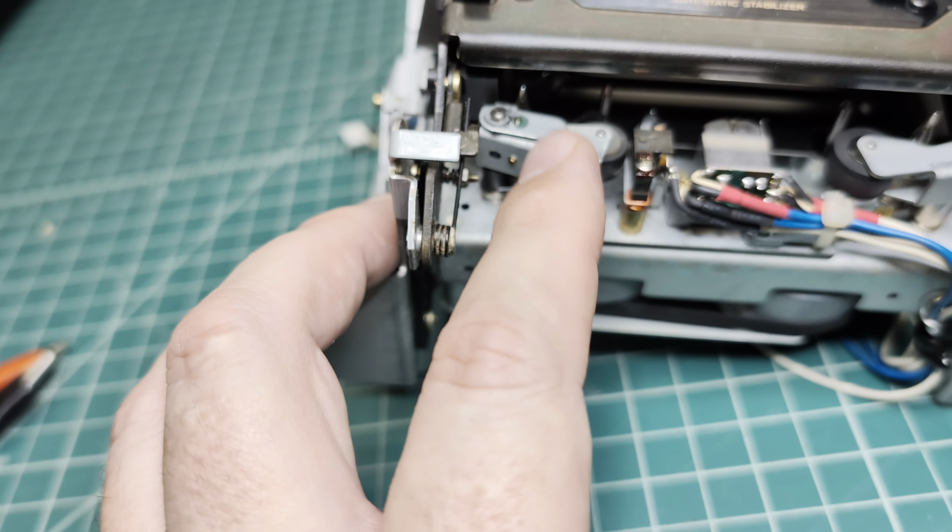Finally I got in. I was able to remove the motor plate — I had to remove the door lever to get access to the screws. The old belt is technically too thick: almost one millimeter thick. It's still stretchy and round, but you can see from the capstan's inside it's shiny because when the belt is installed it wraps about 300 degrees around the take-up capstan and just about 30 degrees on the supply side capstan — that's where slippage is happening and how tape tension is maintained.